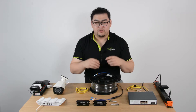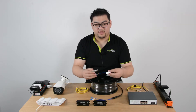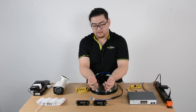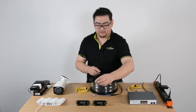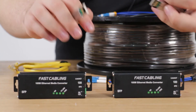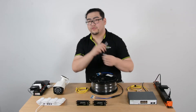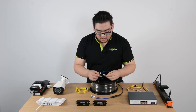Because of the high-speed transmissions, we need to use this module — the SFP module — for Small Form Factor Pluggable. It captures the signal on both ends; it captures the signal and then provides it to the converters. The media converters will convert the optical signal to digital signal, or the other way around, depending on if the signal is going or coming.